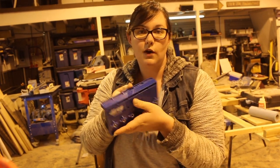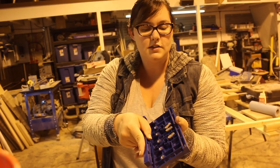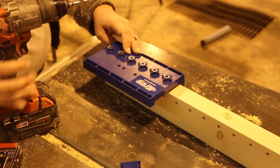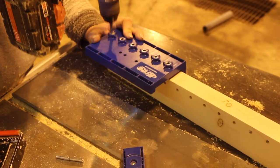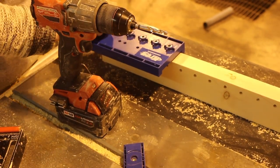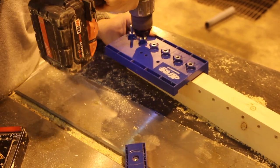The last time I used the pin jig I used the longer side, but this time I want to go from the short side, so I'm just going to pull this piece out, stick it in this side, and now it's ready to go with the short side. Now, going from the other side of the board I just cut, I'm going to drill holes that align with the holes on the front. I checked after the first one to make sure it was aligned perfectly before I went ahead and did all of the holes.